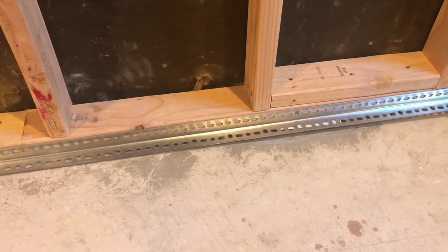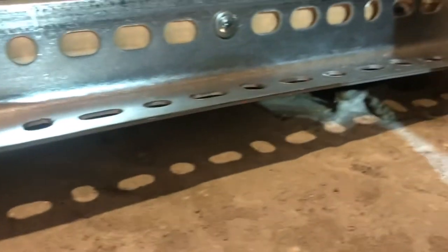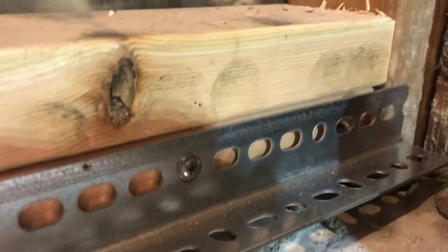Yeah, it's hard to see how bad the floor is from the GoPro, so I'll try from my phone to give you an idea. You see what touching there? And it's low, it's real low. That's how much I gotta fill in. Looks around an inch, inch and a quarter. And it starts to come up again by the radiator, so this is probably an inch and a half here, and that's probably an inch. So I need to bring it up to this metal here, to the bottom.